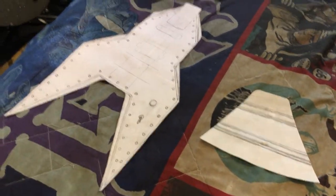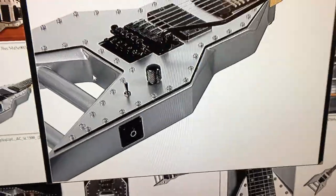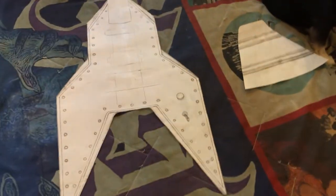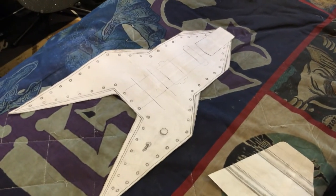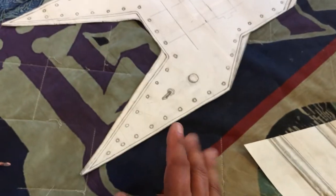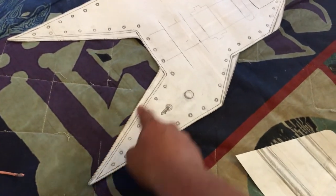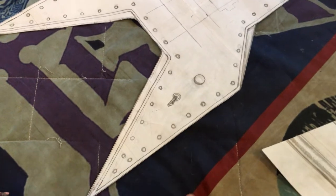I've got to cut out the paper template, and I had an epiphany with this build. Instead of using a three-quarter inch and a half inch piece of plywood, I'm going to use three half inch pieces. That's how I'm going to glue the layers together anyway. Remember when I did the Prince Cloud guitar — the double neck cloud guitar? I did the bevels similar to that. I'm going to have the bottom two layers be the full shape and the top layer cut minus the bevels, then use body filler to fill the bevels in.